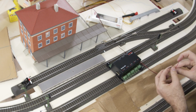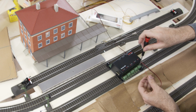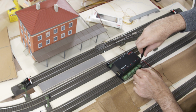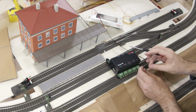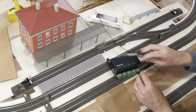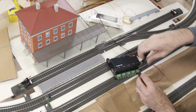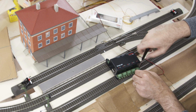Here I have a lot of different ports, but only one is red and one is brown here on the side. I checked the instructions. That's where the M84 must be connected. So the red wire will be connected to the red port, and the, in quotes, wrong black wire from the red-black twin strand will be connected to the brown port. Unscrew it first. All right, now the decoder is already connected to the digital current.